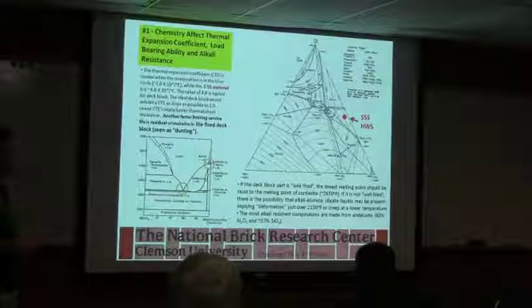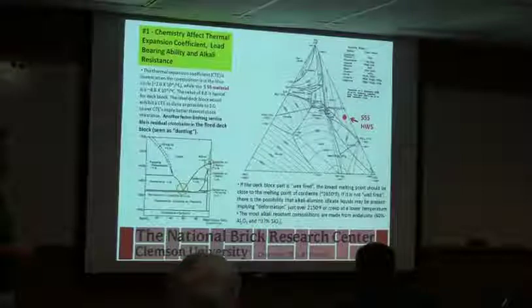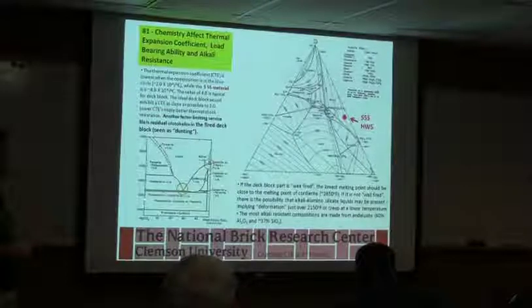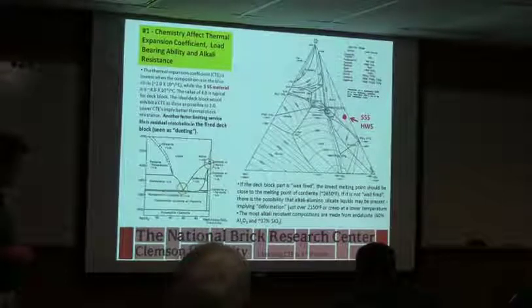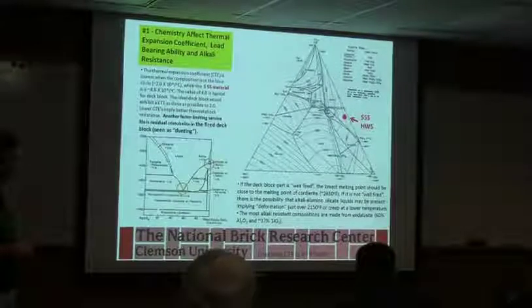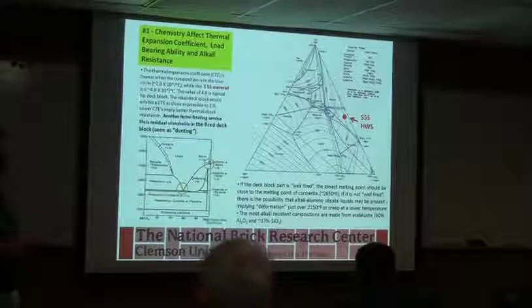Okay, now I'll go technology on you. Anybody seen these before? Phase equilibria diagrams? What this is telling you in a nutshell is that on materials like this one, magnesium silicate and cordierite, a whole lot of testing and studies were done to show, at different percentages, so if you're on this side it's 100% cordierite, if you're on this side it's 100% magnesium silicate. When you go through and produce a 20% mixture and start firing it through the temperature ranges, this is basically the breakdown of what you're forming as you're firing it. And it's the same thing on this.